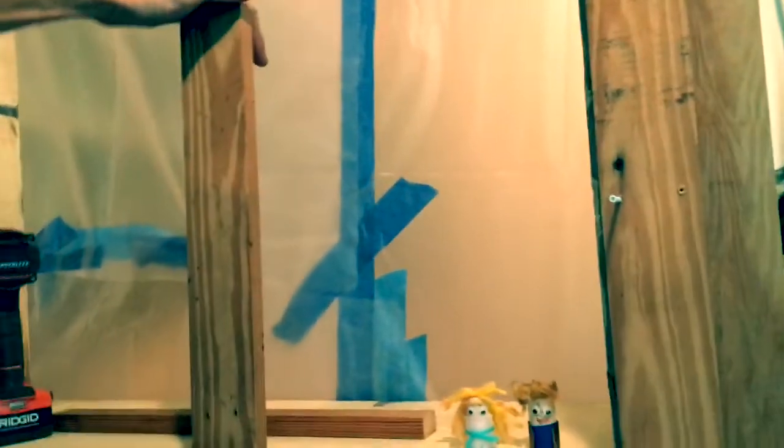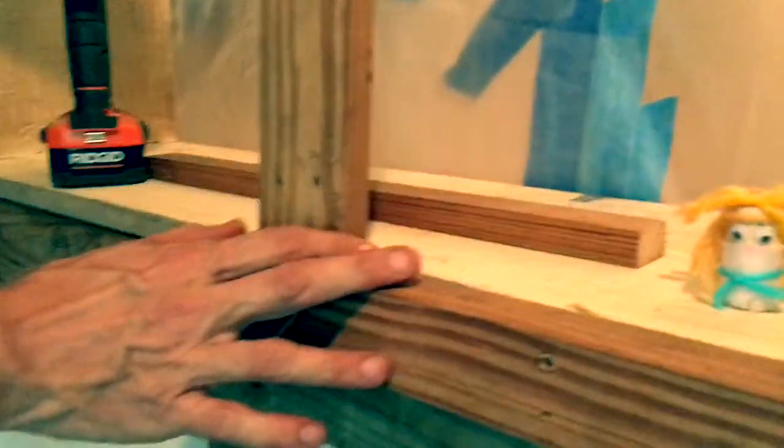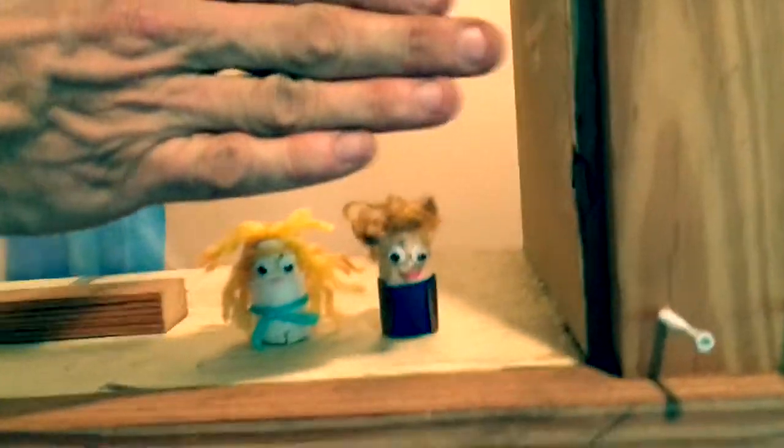Okay, since our frame is smaller than what you will use, and our box is way bigger than yours, this is pretty much what it's going to look like at the end, with a reveal coming on this other side as well. You want to make these two even, but also make sure there's enough distance between the two for the door to shut smoothly and evenly. You also want to make sure that it's all centered on the bottom piece on both sides.